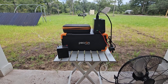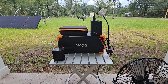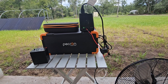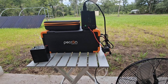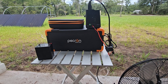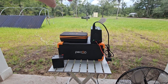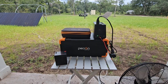Basically a three kilowatt-hour battery pack — it's a 48-volt battery pack. It has the ability to output 30 amps of DC, and I tested the output: it's 13.4 volts continuous coming out of the outlet, kind of where you would see your 12-volt power supply coming in your car. It is currently connected to this little APC inverter up here, which we'll get to in a second.